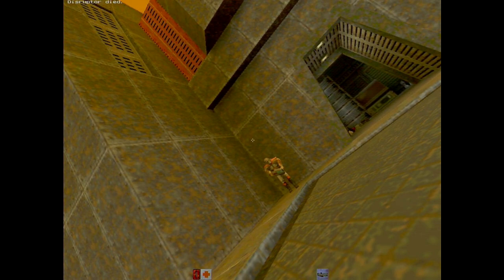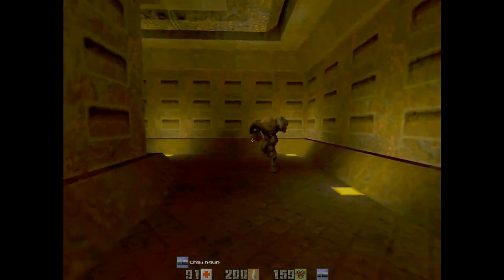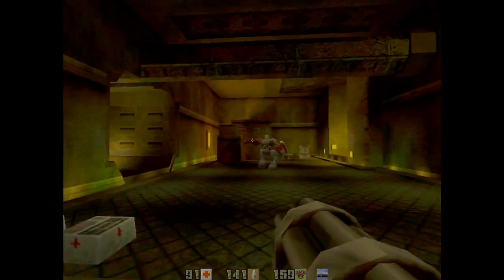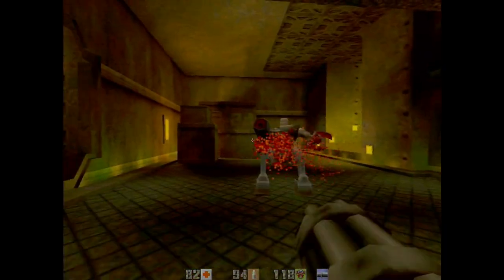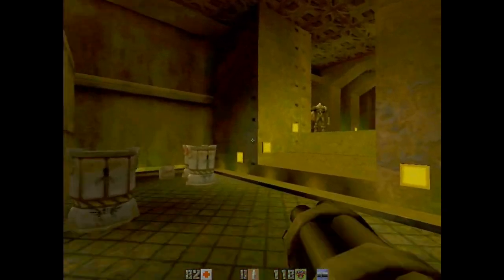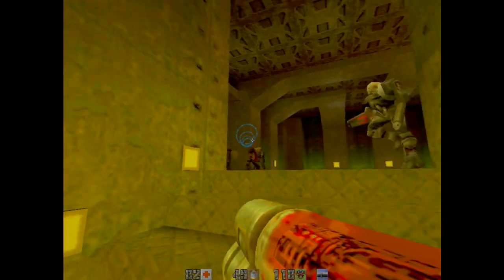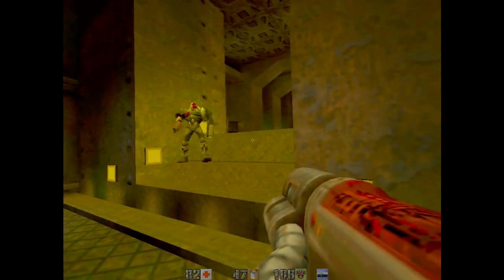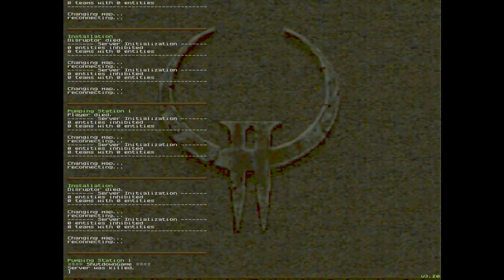So we have a partially working card now, and it wasn't the RAM. I didn't film because I was quite frustrated putting on the new RAM. It was artifacting just like before. So I took the card out and went over all the pins on both TMUs again. And now we have one working TMU. So I disabled multi-texturing. We can enable it again. Do a bit of restart.